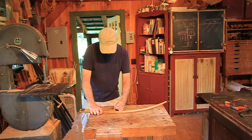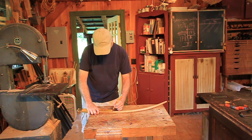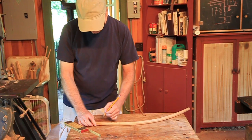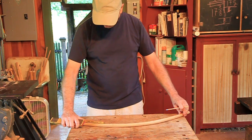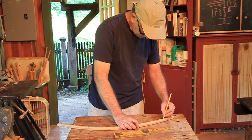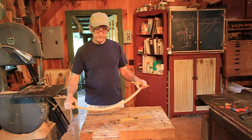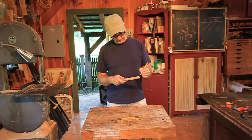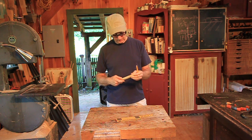So if that's the edge of the post, that's the other side of the post, and let's just give ourselves 1.5 inches. Okay, so it's going to stick out from the post 1.5 inches. So I'm going to cut right there. I got too many pencil marks on this thing. What did I do? 2.5 from there. Excuse me a minute while I just cut this off, because that's not a big deal. Okay, so that's a lot better. Just be taking it down from there, hitting 3/8 right here. So just be a slight slope down, hitting 3/8 and coming out.